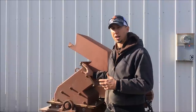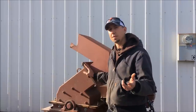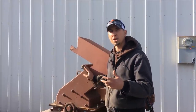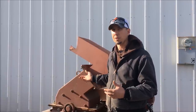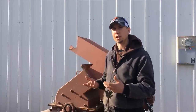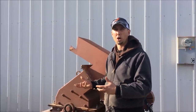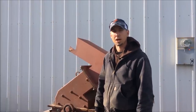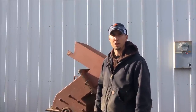We estimate that no matter the size of the hammer mill, when running gold ore the cost of hammer mill maintenance is about $15 to $20 a ton. That is again independent of the throughput of the hammer mill — that's about how much the maintenance costs. We tell our customers that about once a week you should open up the case of the hammer mill and check if you need to replace any parts, see how the hammer wear is doing. The last thing you want to do is run the hammer mill so hard that the armor wears through the case, which we've actually had a couple of customers do. So just keep an eye on your hammer mill and check it once a week. Depending on the application and the material you're running, your wear may be higher or lower.